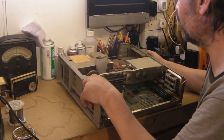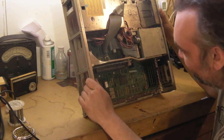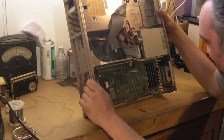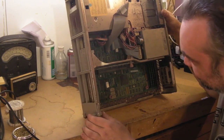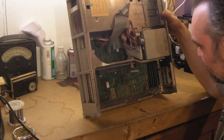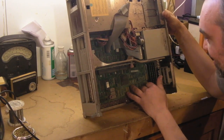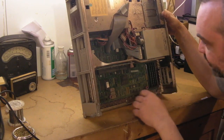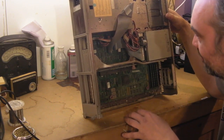Again, I'd just like to see if I can find out whether it's a 286 or a 386. What I can't seem to spot yet is the processor. I've got a date for it, the 1st to the 2nd 91, so it's a 1991 vintage computer, unless it had a repair done in there. I'm guessing that's the date of manufacture, to be fair. I'm worried about actually touching the ICs now, with the fact that that's just flaked off the way it did. We're going to have to be careful, because the printing is just coming off a lot of them chips when you touch them.